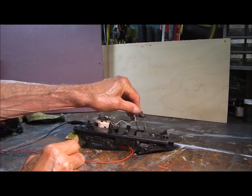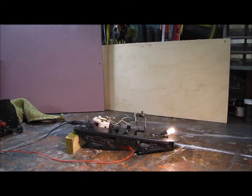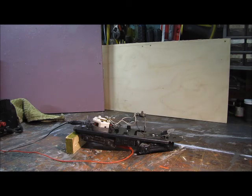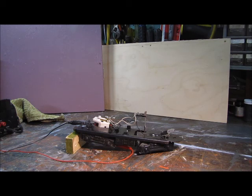Then as I mentioned, you put that in between and you'll get a light but the motor won't go on. So we know the motor works, and just by looking at it and the way it's running, it doesn't hesitate. So I'd say that motor's pretty good. But probably what I'll do is take it apart and see what the condition is of the brushes and the rotor, and we'll do that next.